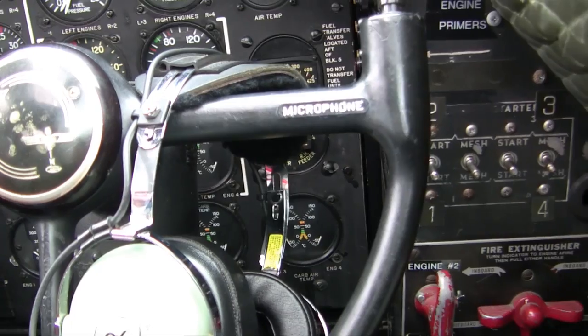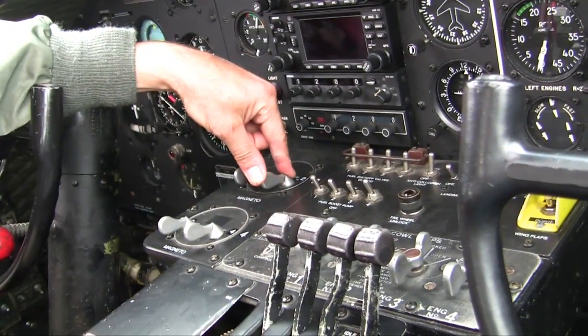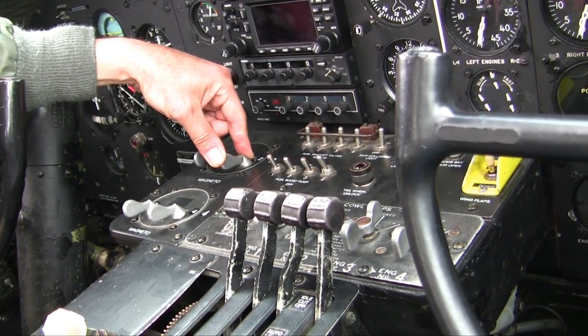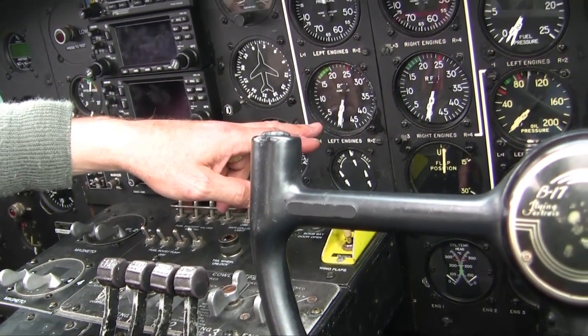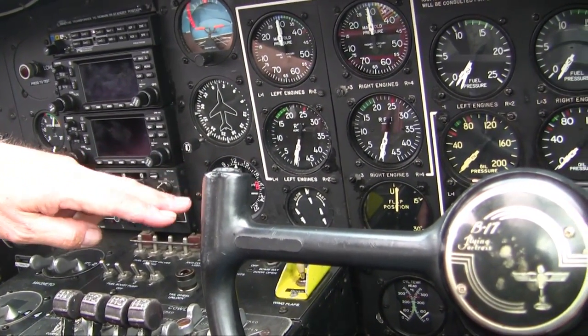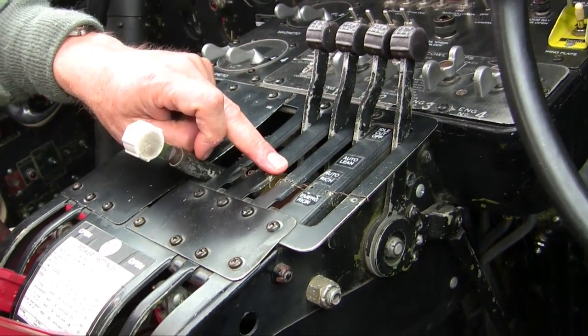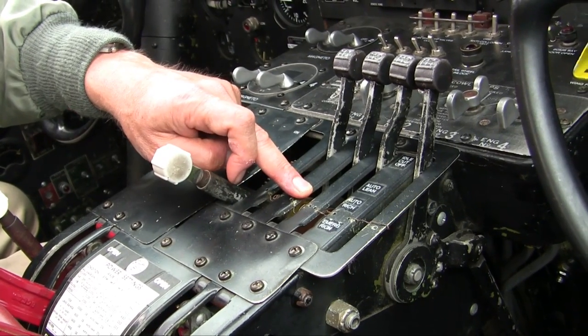At the same time, the pilot in the left seat is toggling the switch on after counting 9 blades, so turning on the magneto, and then waiting for the engine to start on the primer by watching the tachometer. And once the engine is running on the prime, the mixture comes in to an auto-rich setting initially, and then the engine is self-sustaining running on its own.